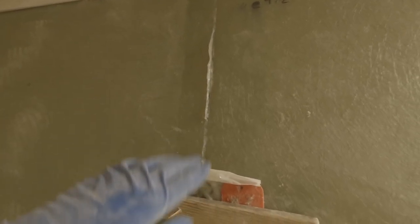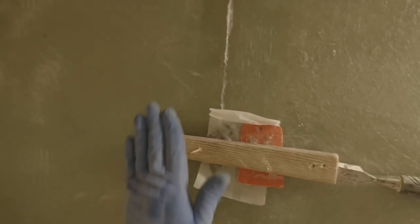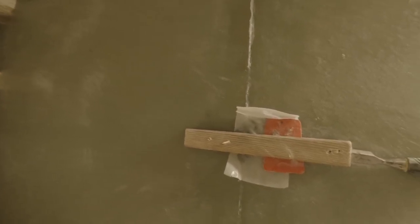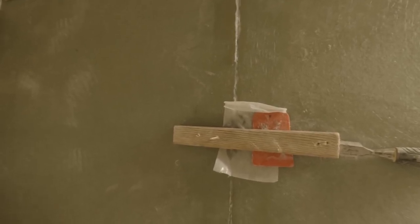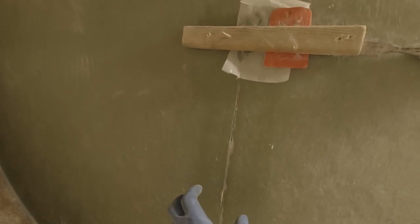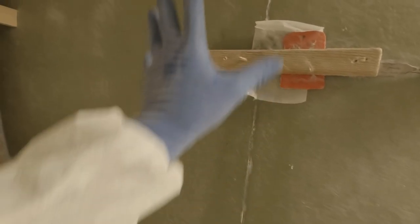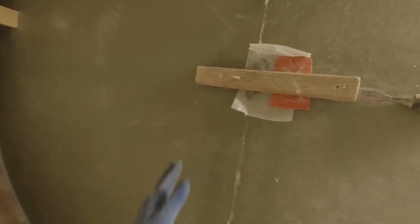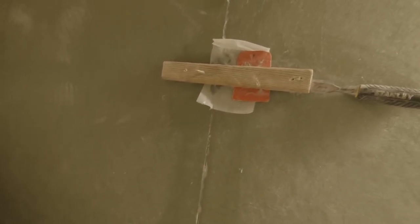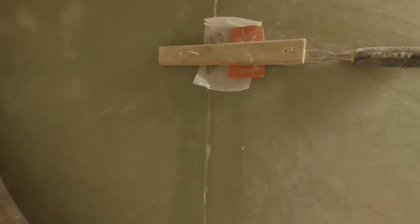We'll just clean this up and bevel it out a bit, and then it'll all get covered up with probably three layers anyways of some 45, some 1708 strips down there that'll tie these panels together, and then we'll build out our framing, and that'll just get covered and basically tabbed into the sides too, and make a good, very strong support.